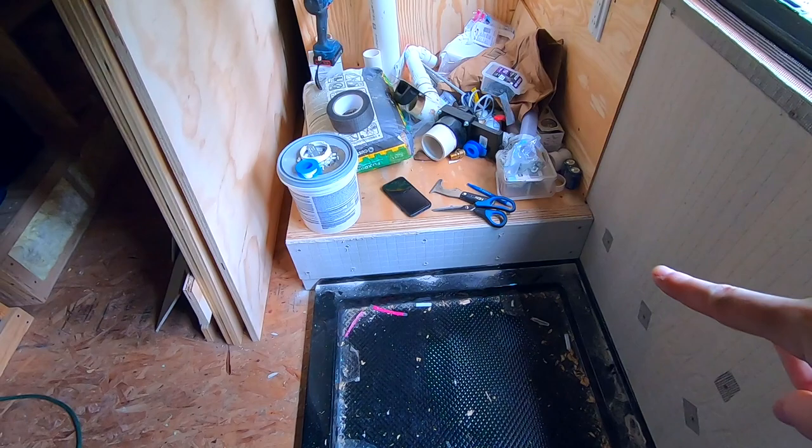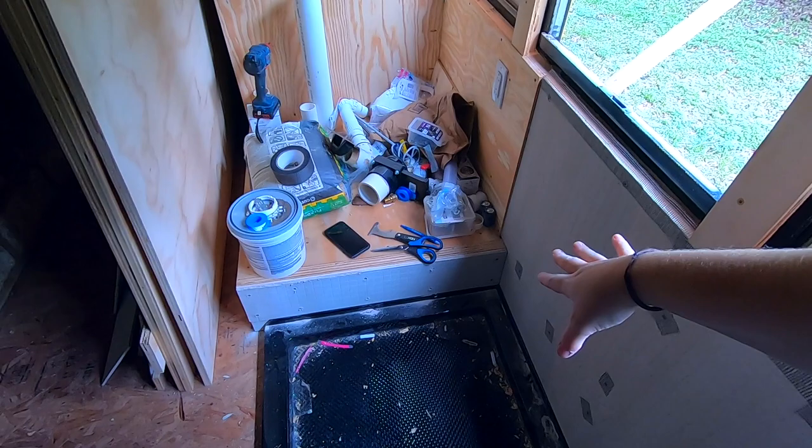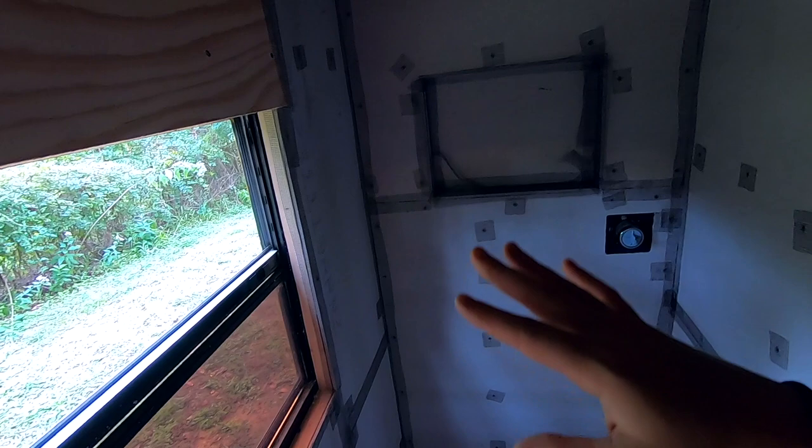So on the opposite side, behind the board right here, we'll do the exact same thing. This will probably just get waterproofing membrane because our shower curtain will be mounted probably here and here, and it will just block all this other area out. And so we are just waterproofing the area where the actual shower will be. Everything else will get the waterproofing membrane that we'll show you here in a second. But this is the beautiful tape job.